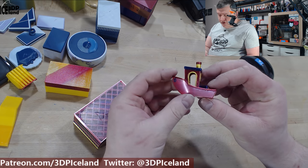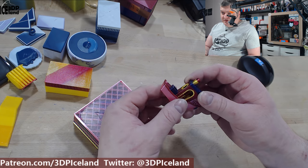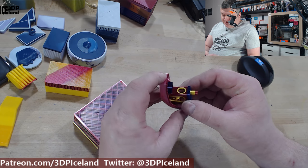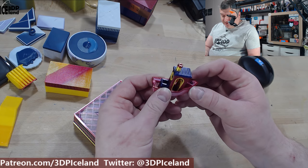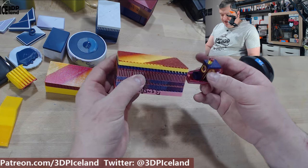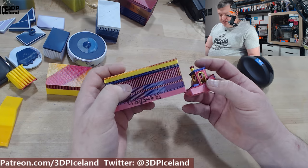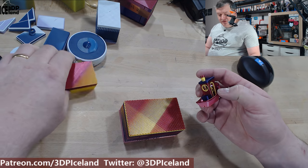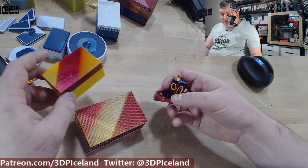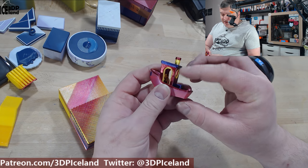Here is a four-color banshee printed with Poly Alchemy filament. I chose this filament because the colors are very saturated. I selected some parts to be yellow, some pink, red, and blue. This print was coming out excellent with really clean transitions between the colors. The purge block for this one is quite big because it's four colors changing throughout the model — if you add more colors the purge block will need to be bigger compared to a two-color print.